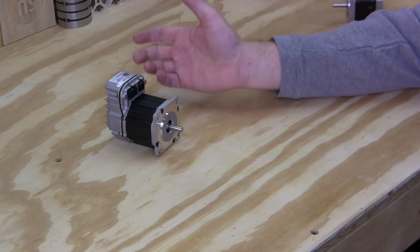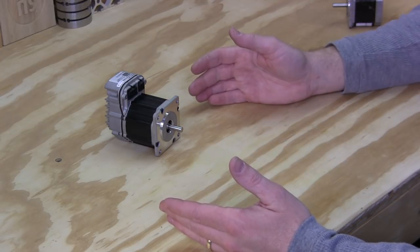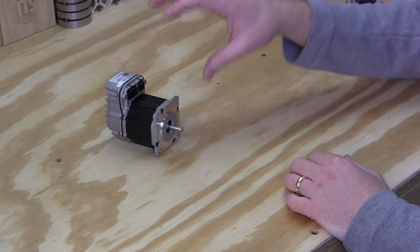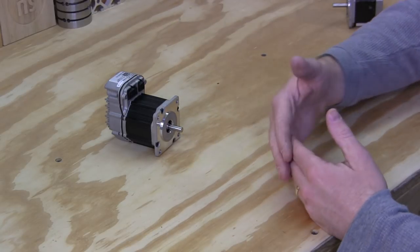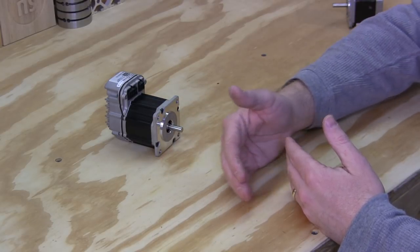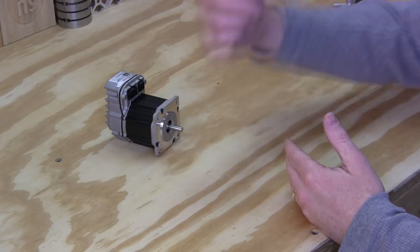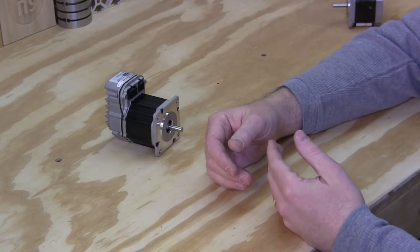if you have a linear actuator like the ones that I have used on my mini CNC machine, obviously it has a hard stop min and a hard stop max. It can only go so far. There's a hard stop feature, or the homing feature of the motor, and once you set it up, the motor will retract to whatever the home position is, and when it hits the hard stop, either the min or the max, however you've got it set up, it can sense that and trigger your system to say, okay, I'm at home. So home would be like a zero position for the CNC machine.